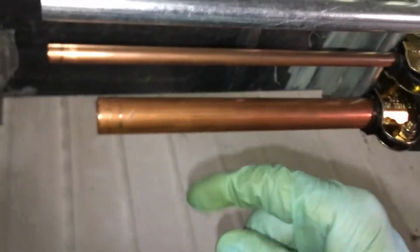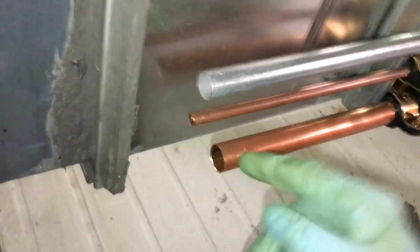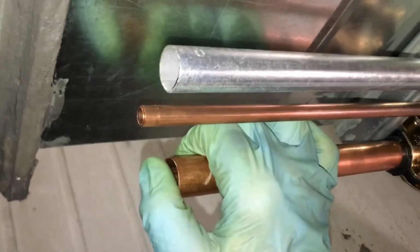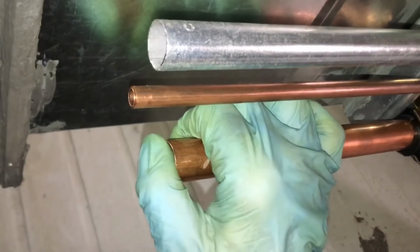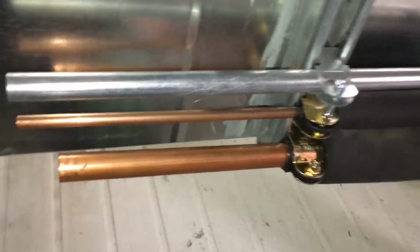And then if you have too big of a pipe like this and you have flow out of it and you have it down on braze, remember, the larger your diameter, the less your flow. You have the same volume, but you have less velocity. So you won't feel the velocity you will out of here. So one secret to that, if you want to know if you have nitrogen flow, put your finger over it and make a very small hole like this. Now you'll increase the velocity and put your face down there, put your lip or your eye or whatever, and you will feel that flow of nitrogen. That means you have flooded your pipes with dry nitrogen, displacing the air.